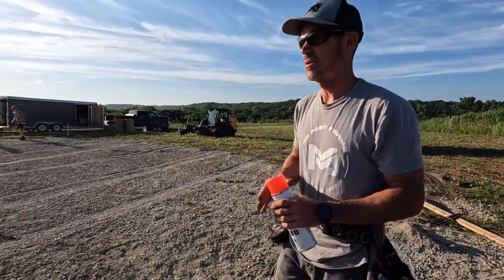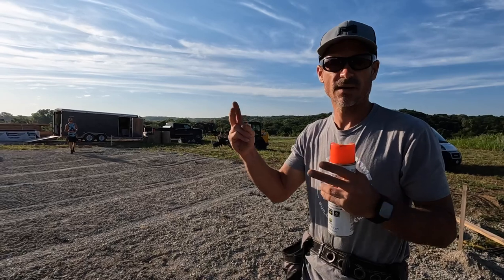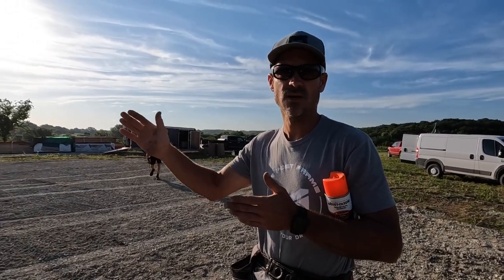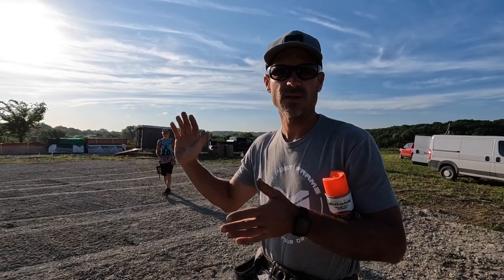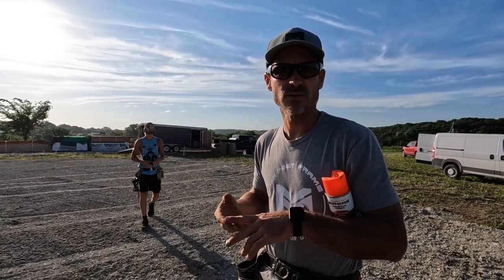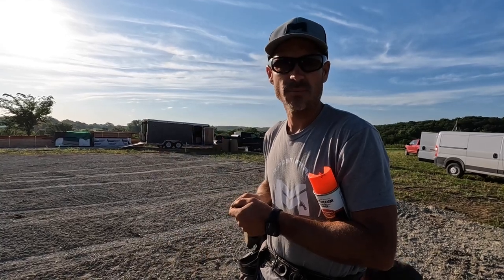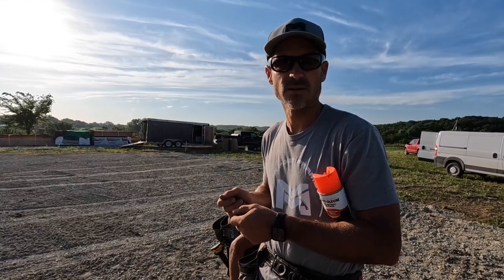All right, so all we did is we know we have two known measurements. We have the length and the width, so we have 80 by 56. We used the Pythagorean theorem to find the diagonal, which was 97, 7 and 13/16. And then we just meet those numbers up at the corners, and that's how you get the building square.